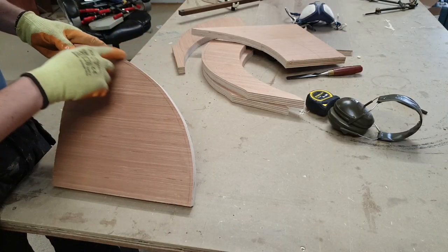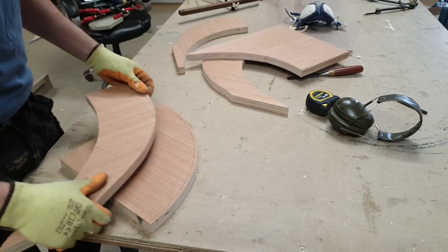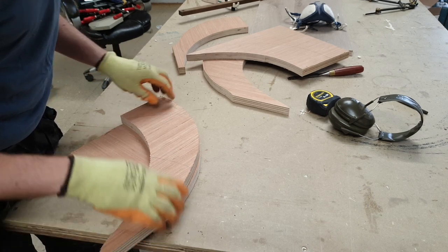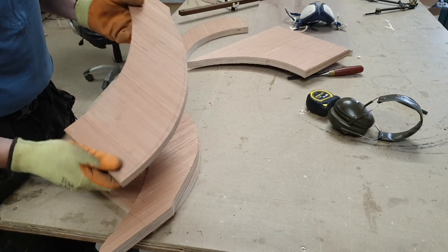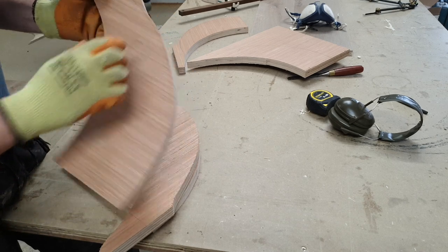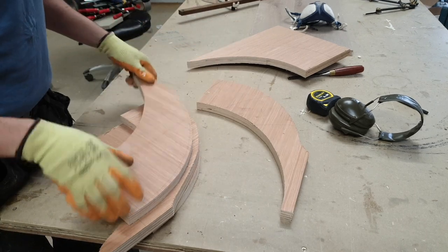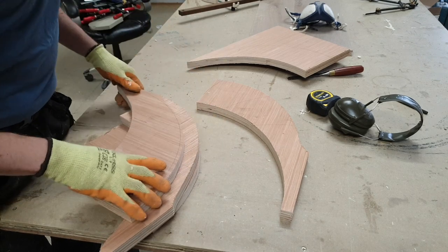Okay, so I've just cut on the outside of them lines. What I'm going to do is glue them together now. So I've got a nice curved section available. Get them all glued alternate so there's strength both sides because of the material tapering off. It's a bit narrower there. I'm just going to rotate them so that there's alternate strengths. You don't have to, as long as there's enough material there to take the strength of that veneer, it's fine.